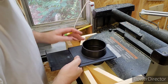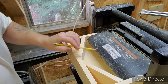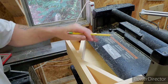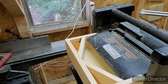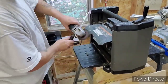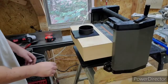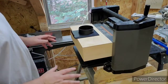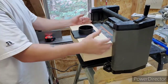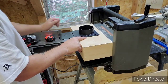All I've got to do is get this in the center — there's going to be a little mark. Now I know I need to cut out just a little bit more than that mark, just a little bit of that shroud right there, and then my blast gate will be able to set down in there. So we pretty much have it completed, except I'm going to paint it black. It will get screwed into this guard here, here, and here — nice snug tight fit all the way around, with the baffles in there to bring it to the center. My blast gate is right here; when I'm not using this, I just close it off.